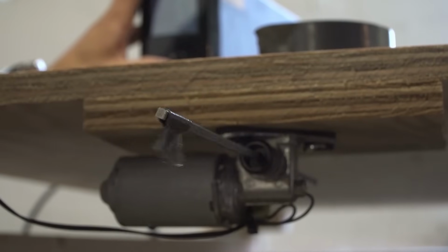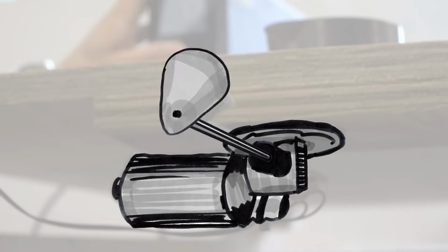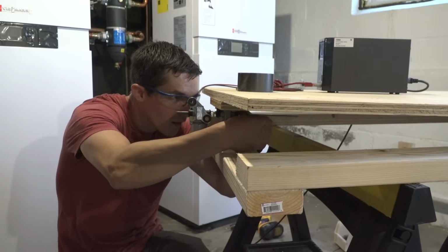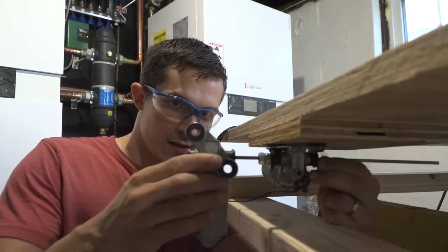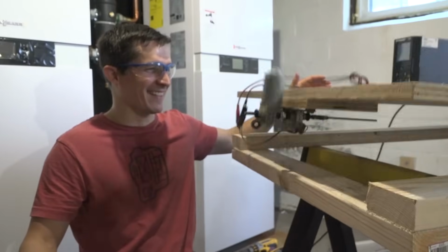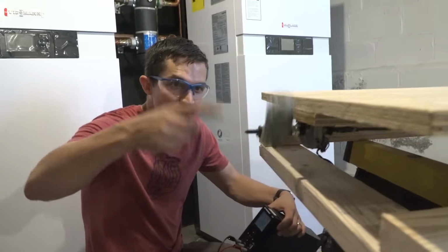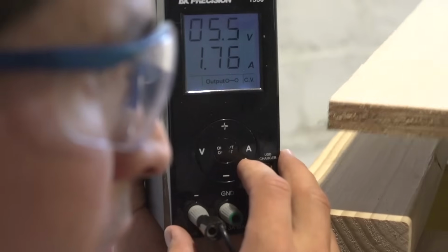The motor's gonna spin a shaft, and I'm going to attach something heavy to the shaft that's off-center, so that when the shaft spins, the off-center thing swings around. It'll help me convert rotational motion to up and down momentum. It'll be just like the vibrating motor in a phone, just slower. Rather than try to make something difficult and complicated to attach to the square shaft, I can just use another motor as the heavy thing. All right, it works. When the motor's speed matches the natural frequency of the bouncing platform, we should see it shake a lot more.